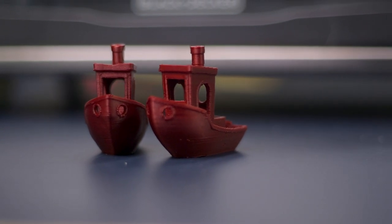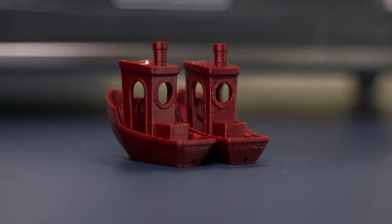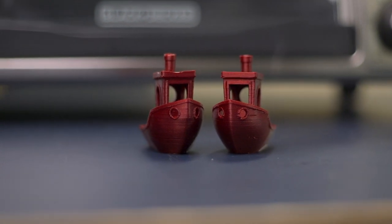You may notice that your part has shrunk or changed shape slightly. In that case, you may be able to reprint your part to account for the shrinkage and growth. Like if a 100mm long block shrunk to 99.5mm, then you would want to scale it up so it shrinks down to 100mm after annealing. And really that's all there is to it. It's not an exact science, but by the end of this you should have a 3D print that will withstand temperatures better than it would have before annealing and have a little extra strength in general as well.